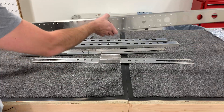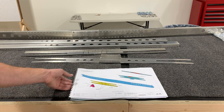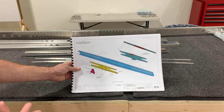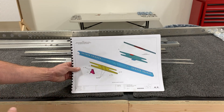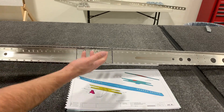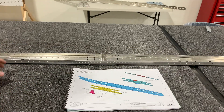You'll see I've already got all the parts for this next page deburred, cleaned up, and ready for assembly. We're going to begin on the next page — there's no dimpling and no countersinking required on this particular step, so we're just going to begin with Clicoing and assembling, making close note of the holes not to rivet as well as the rivet direction. Now this page is complete. I leave marks on to let me know where not to rivet, and those wipe off easily with acetone later. This part is now complete and we're ready to move to the next step.